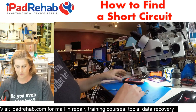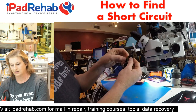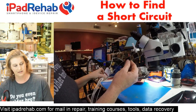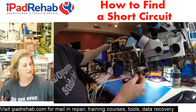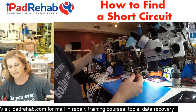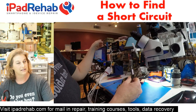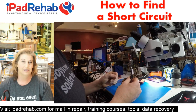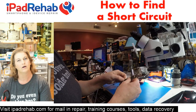And I will tell you why I think it has a short circuit, because when I connect it to DC power supply, so I've connected it using the iPad Rehab Power Squid. It's connected up here to DC power supply. We'll plug that in on both sides. So we're sending that battery voltage into the battery connector, and now it's in the phone, and it is drawing zero amps of current, which is normal for a phone, so it doesn't have a short on the battery or